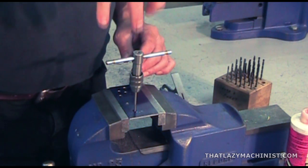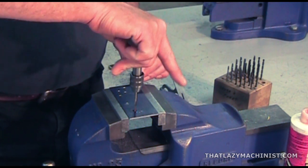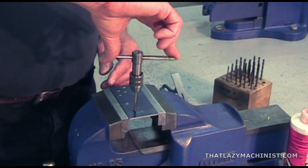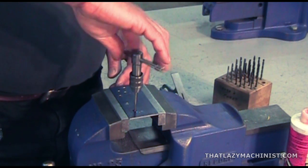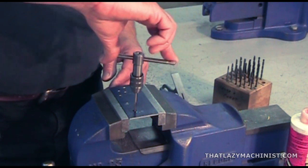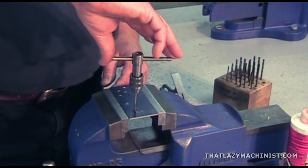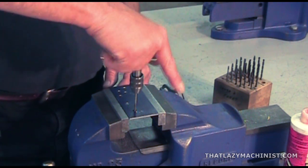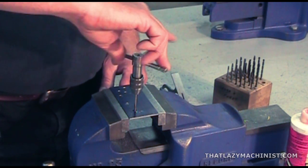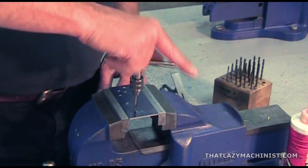It's important that you don't hold the tap handle, but that you just turn the tap handle by applying an even pressure on both ends of the tap holder's drive bar. The tap has a hard enough time resisting the torsion. It doesn't need to be bent as well. Now back off the tap regularly. This breaks the chip and reduces the amount of pressure required to tap the hole. I generally recommend a half turn forward and a quarter turn back. As your tap works its way through the part, it will become easier and easier to turn.